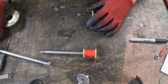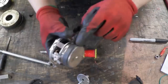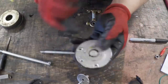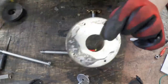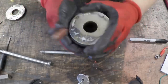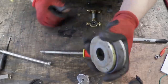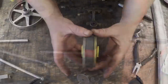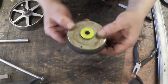The final thing we need to make the whole thing work is a magnet. Magnets are absolutely everywhere, and I'm using this from a speaker — specifically this section here. If you hit it hard, the lump will come off and you'll have two bits of metal: the central core and the actual magnet. When you separate those out, you have the disc of metal and then the ring magnet itself. You need the disc and you need the ring — you actually need two of them. So that goes there, this is from another magnet, and of course I could stack the magnets up, and the other disc goes on the other side. That bit there is part of the generation, so you need that — that's the generation coil together. The coils are glued on that bit, they've got a magnet in between, and then another lump of metal with the coil coming out.